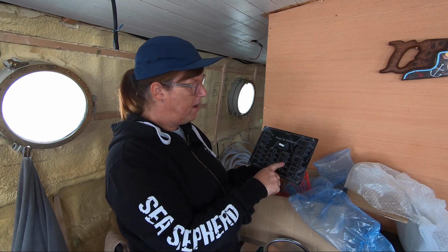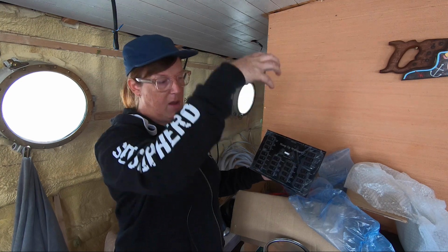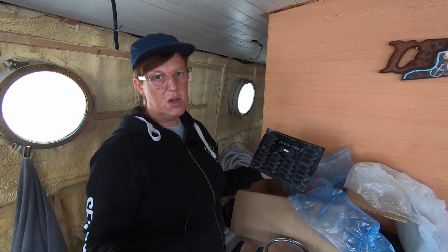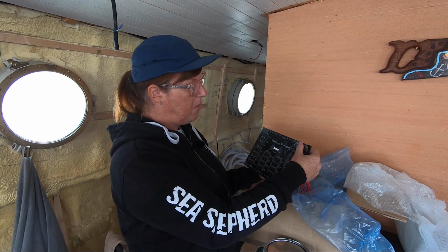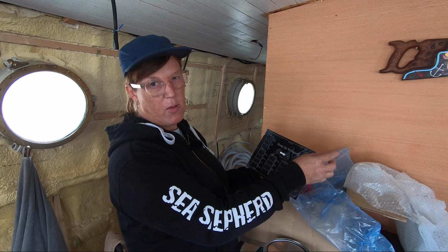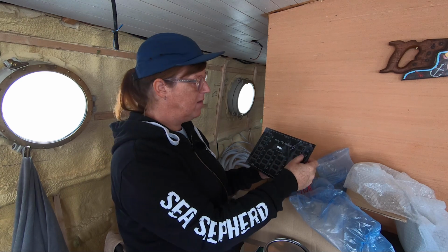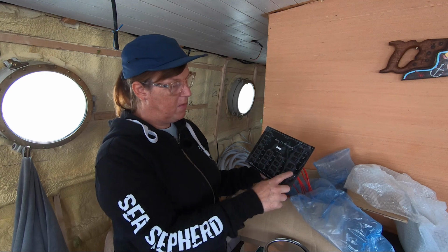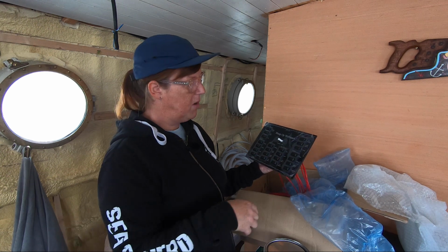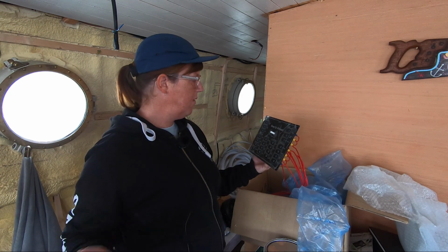And then I've got all my auxiliary lights. I'm putting in wiring for deck lights as well, which means that I can have lights up the mast, which will shine down onto the deck. Which will be useful for moving around there at night, and also my auxiliary, I'm wiring in a 24-volt socket on the deck outside for extra things, floodlight, searchlight, that kind of thing. I've got my cooker ignition, I've got my 24-volt fridge, and then all my pumps, the water pump itself that makes the pressure. I've got a shower, a galley, and a bathroom sink, and then the name of the boat is on there as well.